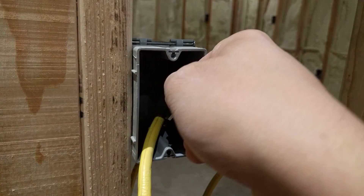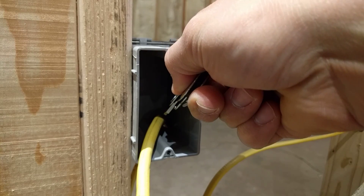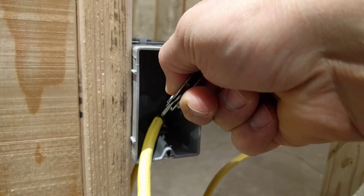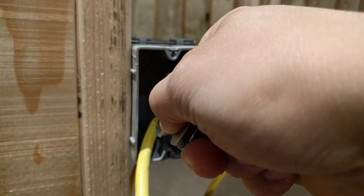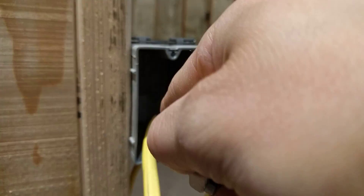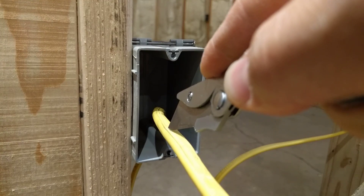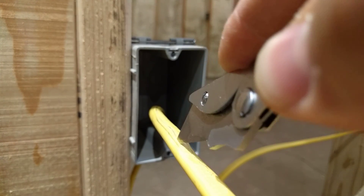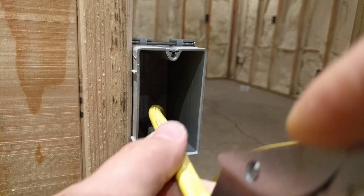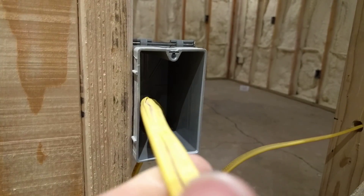Keep your blade starting at about a half inch from the back of the box — I like to leave about a half inch of sheathing in the back. Make sure you keep your blade going right down the center of the wire, because there's a bare copper wire there that you're really not going to damage. Careful not to get your fingers. There we go.